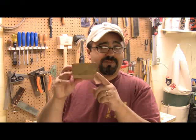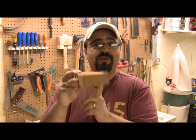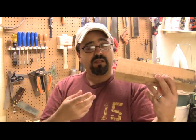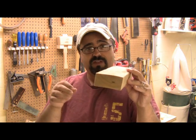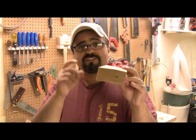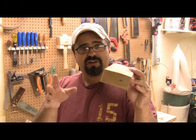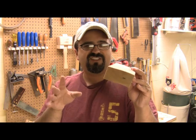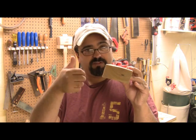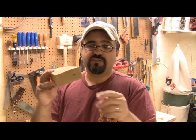Just for a little piece of trivia, I picked this up off of a pallet from a delivery we had here at the house when we had some flooring not so long ago, and basically it's maple, and it works great. Now, it was a little wet when I first got it, so it's been sitting around and acclimating to my shop. That was the most important thing — to get this wood as dry as possible. I have about an average relative humidity of about 6% to 8%. If it was a little bit less than that, it would come up to the 6% to 8%. If it's wetter, then it comes down.